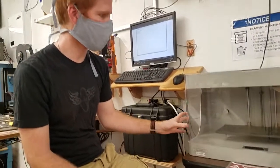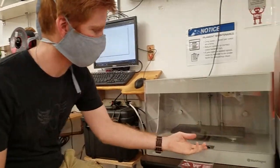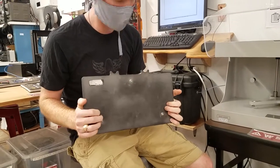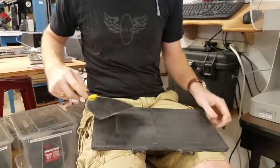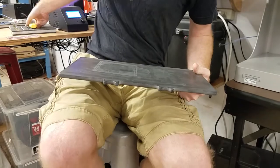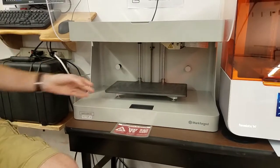When you go to use this printer, one thing to be aware of is it has a removable build plate. Rather than having to use a spatula and fight to get your part off while the printer moves, you can just pull this platform right off. It reseats itself via three bolt heads that fit into little magnetic feet in the printer. That makes it way easier — you can take it out, grab a spatula, and use the flat of the blade to scrape off your part. Then just line up the three bolt holes and place it back; you'll feel it seat into place and it only fits on one way.